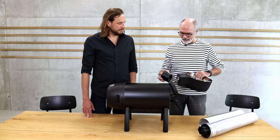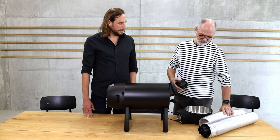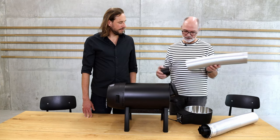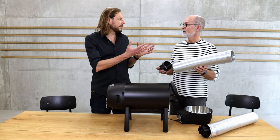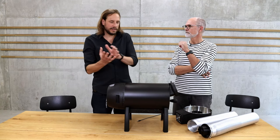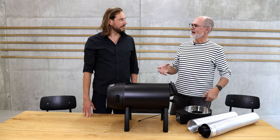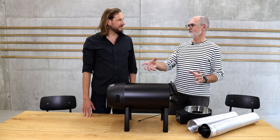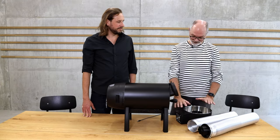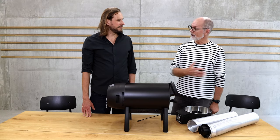And so in that case, you just need to connect this. Again, the aluminum flexible hose can be connected to this part the same way as we did. And it's the same 100 millimeter aluminium. Do I have to look for something, does it have to go up first? I mean, you shouldn't have a very long distance, of course. But if it's only a short distance, even up to a few meters, the speed of the air is pretty high. So it will be pushed out.